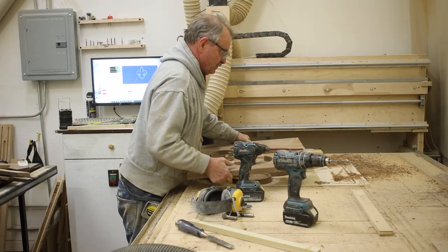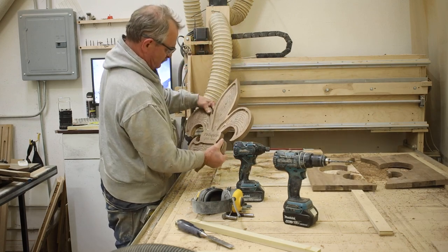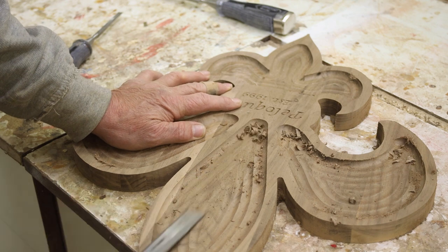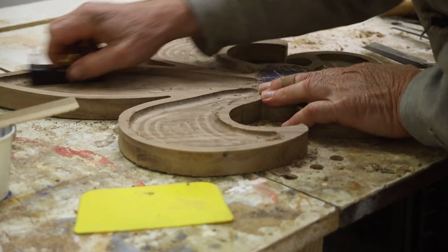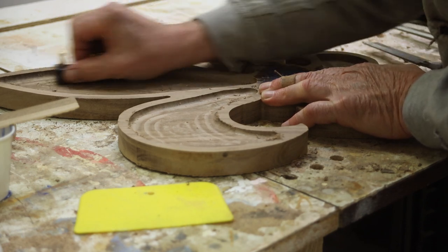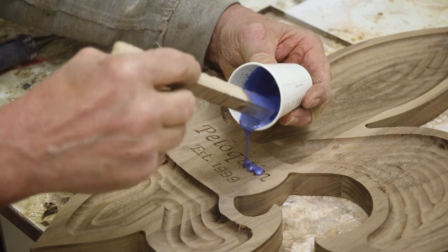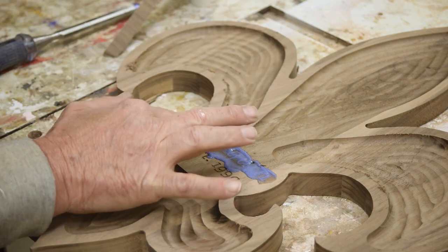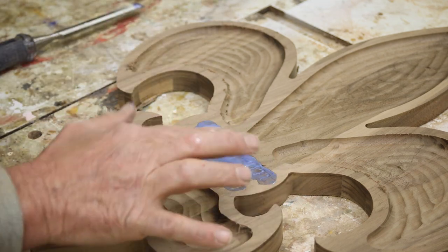Back to the other board. I did the overlap too big and created a bunch of ridges that I needed to use a sharp chisel and the cutest little plane you've ever seen just to take all the ridges out and get it close to smooth. So I fill all the engraving in so you don't get any grime or bacteria down in any of the pockets or voids. I think it helps to let her stand out.